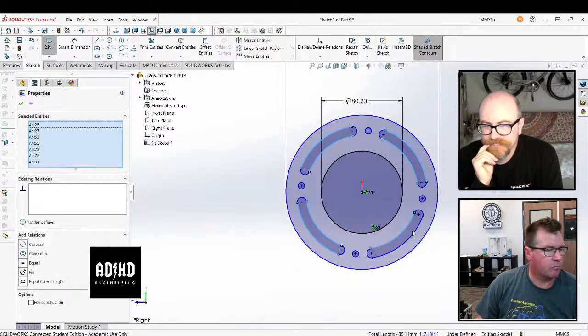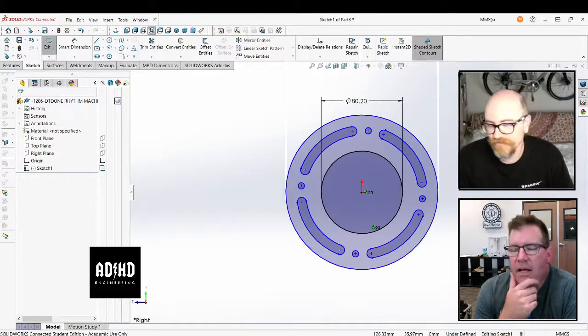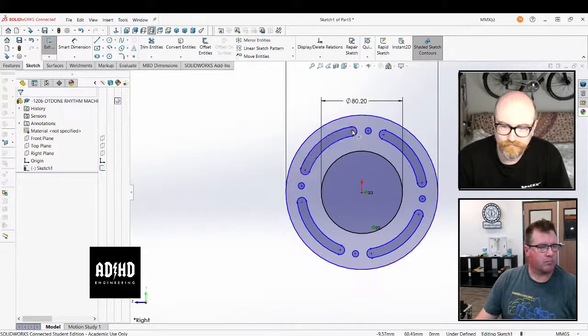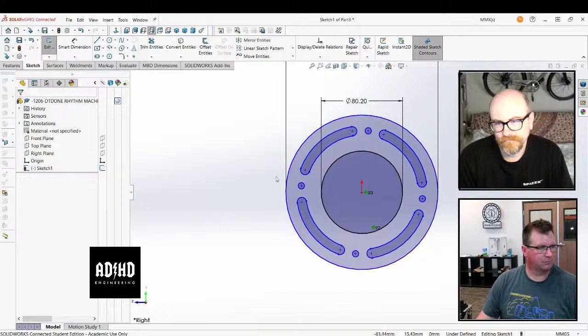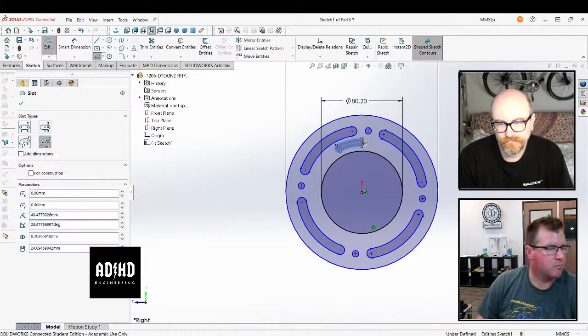I think more than anything else, you're showing the effort involved in doing an IGES import, trying to recreate it, and then reestablishing all your relations is actually not easier than just making it again. I mean, some things might be more convenient. Well, we need the original dimensions, right? So you might as well start by making it again. Going back and forth between SolidWorks and Fusion is going to take longer than just back engineering simple extruded parts, because this is just copy, paste, import, fully define, extrude, done. Instead of actually drawing everything out, because this is just a convert entity and you're done.